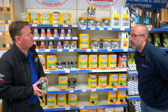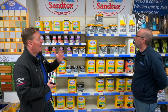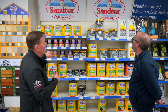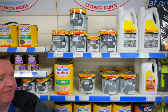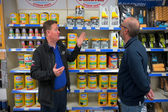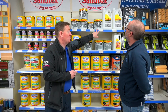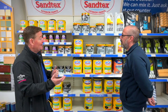Flexi-Gloss is the trade version. It's designed to be highly flexible with timber and PVC. So if you've primed your PVC with the primer, Flexi-Gloss is an excellent product to finish it with. You need to use the flexible primer undercoat and the Flexi-Gloss together. If you use a standard undercoat you're wasting your time putting on Flexi-Gloss because you need a flexible surface underneath it. Use the two together and you'll get the performance it's designed for. It comes in bases so you can get it mixed in any colour — it only comes in about seven colours.